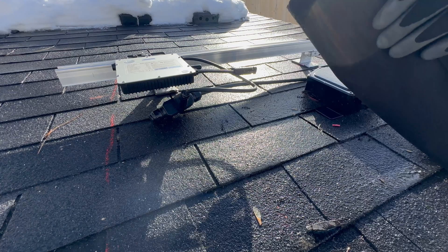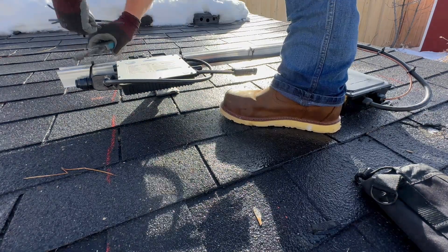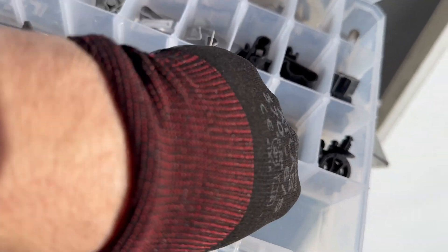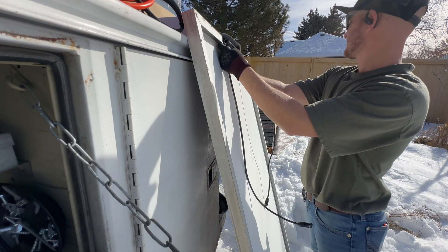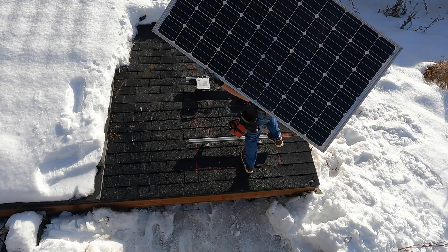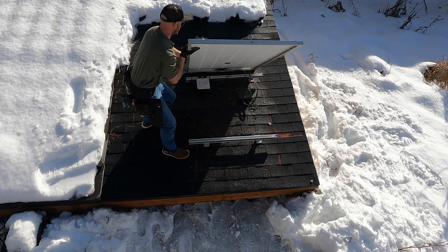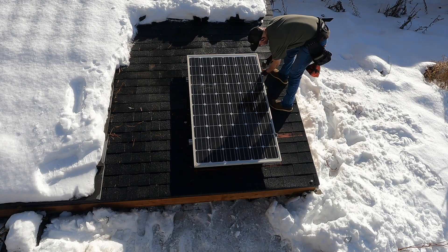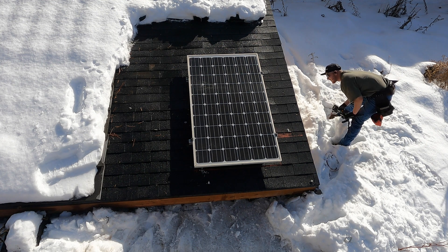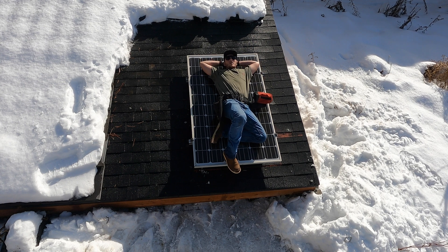Once that's all cleaned up, I'm going to put the lid on there and tighten up the attachments. It's very important to have all your wires off the ground. I'm just using some high-quality cable ties here, but there are a lot of different products made specifically for holding up solar panel wires — metal clips and other options out there. I highly recommend using quality stuff to make sure those panels don't sag over time. Now I'm carrying this panel up and getting it ready to set it. I'm going to set it down where the cables are, plug it in, and then lay it down. Solar panels are pretty heavy, and if you're up on a roof, be careful — this is really dangerous. I always recommend being harnessed in, maybe doing a two-person job. I install tons of these every single day, so making sure none of the wires are hanging down and the solar panel system is installed with quality.